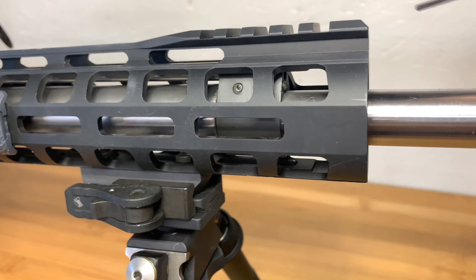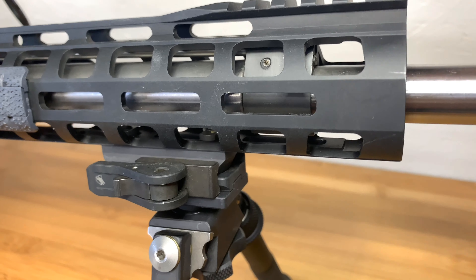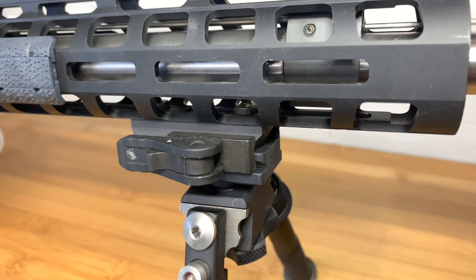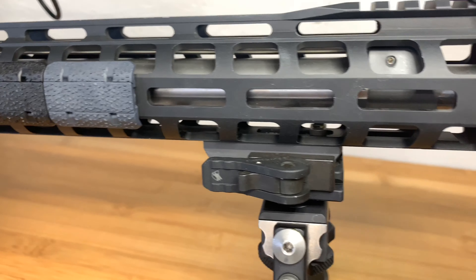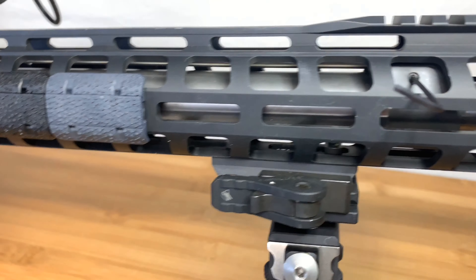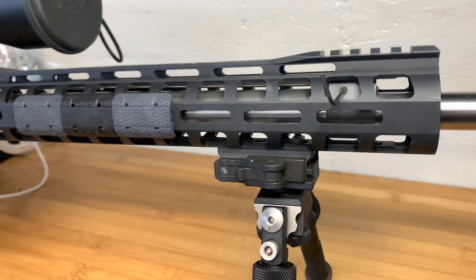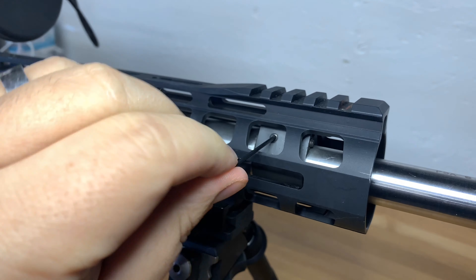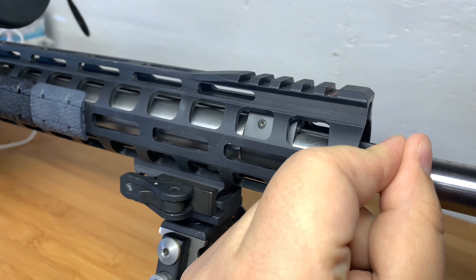There's basically two screws — you can see the one right there and the one right there. They use an Allen wrench. This one is a lock, so it locks against the threads of that adjustment screw. To adjust, you break it open just a little bit, take pressure off the threads, insert the Allen wrench, and turn it right to close off the flow of gas, or counterclockwise to add more gas. Then when you're all done, you lock it back up by turning that lock screw.